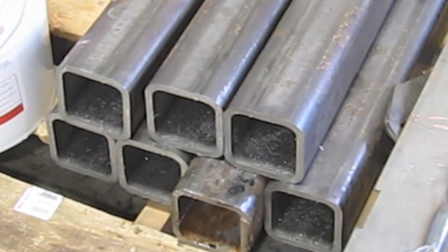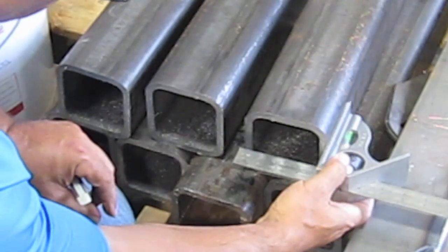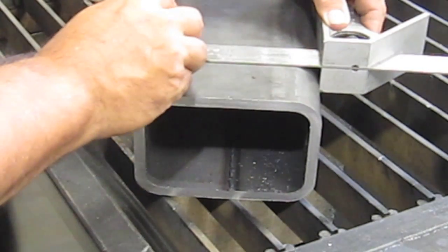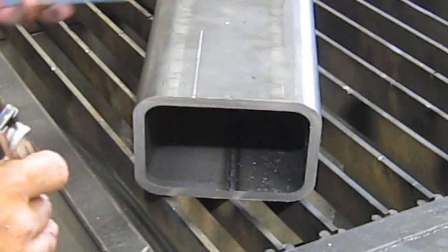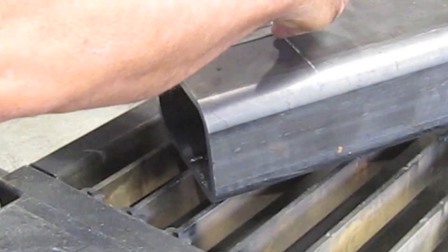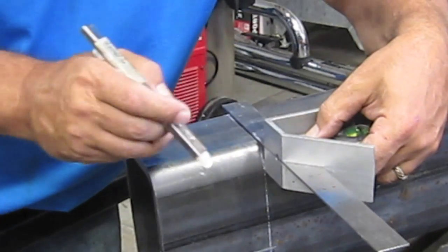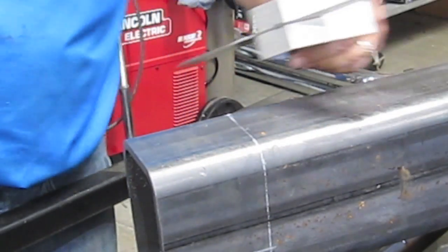Back to the rest of the project. This is four-inch tubing. I'm going to get a quick dimension off it to see how many are running a little over four inches, and lay out some cut lines on this three-by-six because that notches right in here and nestles into the end of it. This is the wide base square — it's called the LaSquare, from LaJesseProducts.com. It's a little pricey, but so useful. It's really good for square tubing because you can carry the line over the radius, whereas it's really tough to do on a narrow-base square.